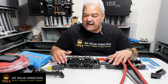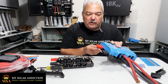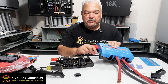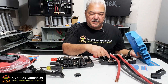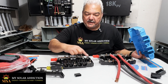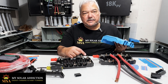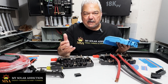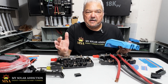I'm going to have to modify it so that I can get the cables to come out the side. I want to have double 4/0 out. I can do one connection by putting a bolt on here and bolting the cable on, or one of the 4/0 connections. The second one would come from here and I'm getting some angled 4/0 lugs so that it'll go down on an angle and then come up and out. So I'm going to have to cut right here to create a way for me to stack these two negative connections on the side, because my wiring trough isn't big enough for me to go out the top.